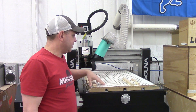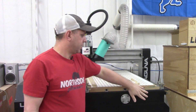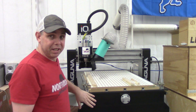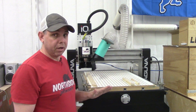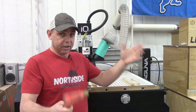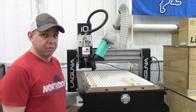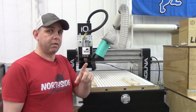This machine has a 2 feet by 3 feet working area and it comes with aluminum T-slots with pretty thick waste board MDF in between each one. This table is made out of solid metal so it weighs 425 pounds or so somewhere around there. You can use an engine hoist or several big guys to move it, but be sure you have some way to move it around. What makes it so great is that it is heavy — it's not going to move around, it's not going to flex, and you're going to get great cuts with it.